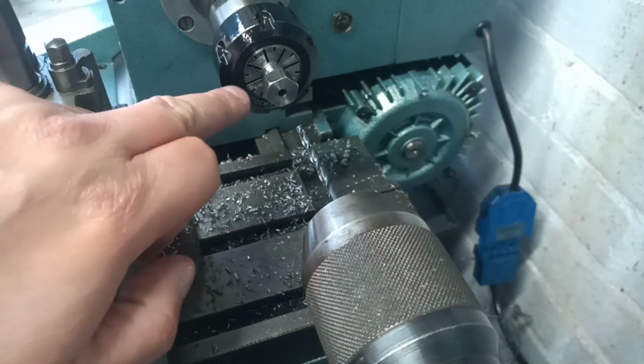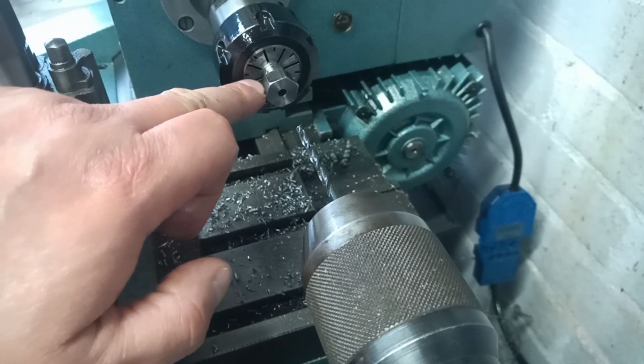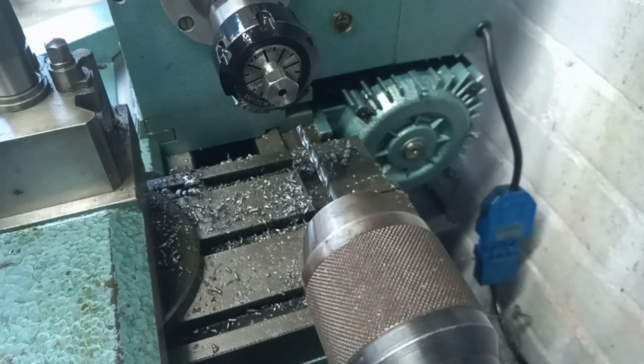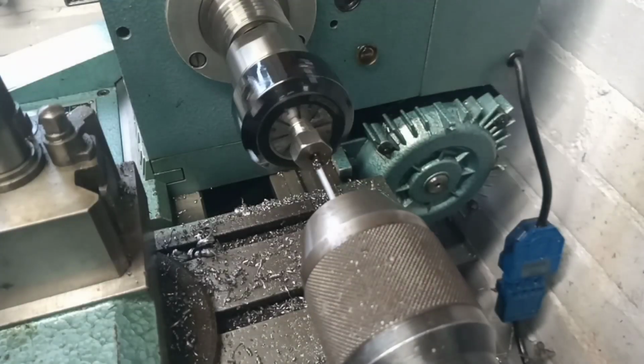And I've already slimmed the head down. I've gone a little bit deeper. They're a little bit deeper than the originals. I think the originals are about 6mm, and I've done these at 8 because I think it just looks quite nice. So they'll be differentiated from original components, but I don't think it will look out of place. In fact, I think it looks quite nice. So right, let me get set up for tapping, and we will put some threads in.